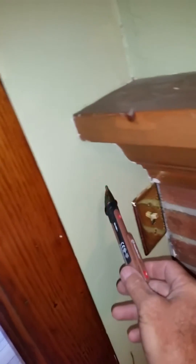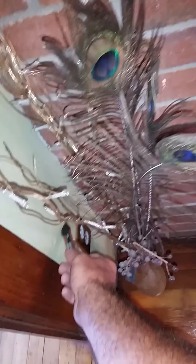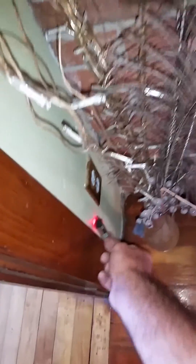Even if I come over here away from that fan, past the light — now here's the chimney. There's not much power there, which makes sense — it's brick. And then here's an electrical outlet. So all this knob and tube — tons of power all around. The wires aren't insulated very well. I have power that far away from the switch.